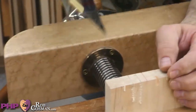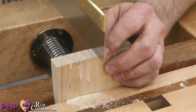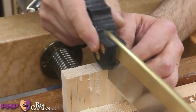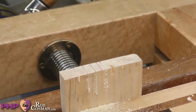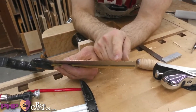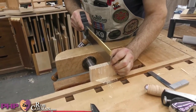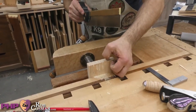So the first 2 inches are small teeth, relaxed cut, relaxed angle, allow you to go in and just create a little bit of a groove, just enough to hold the teeth, so when the big teeth engage, they're not jumping around, they're already set on a track, and away you go with tremendous precision. When I sharpen this, I actually would ignore these first. These don't need to be sharp. They just need to be in. In fact, I could almost say the duller they are, the better, because then it offers even less resistance, and all you want to do is score, just enough to catch your thumbnail.